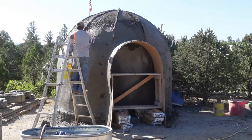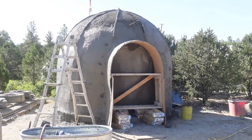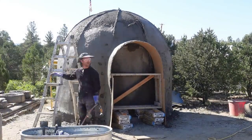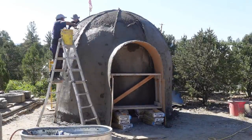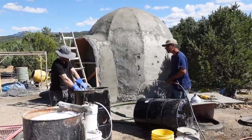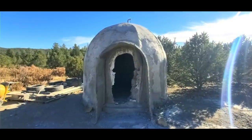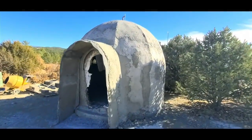The arch framework uses simple two-by-fours with bags of sand underneath to get the right height. There were people worried about how the arch would come out, but once I showed how simple it was, they were very relieved they'd be able to make a nice archway. You can use that same system for making hallways and other things. Now we began to fill the cavity with aircrete.